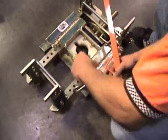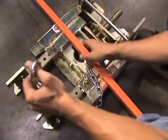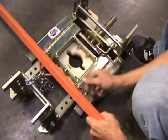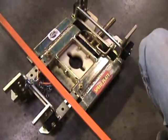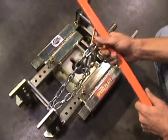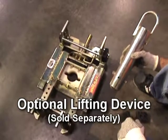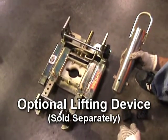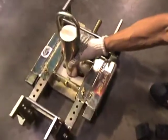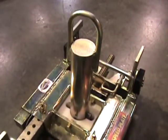You're going to want to clip the safety bar on the opposite end of the threaded wheel, which is your heavy end. That just keeps it from dropping down in the hole. Once your speed plate is locked into position in the frame, remove this before the cutting operation. It's used in cases where you want to use your six shooter to cut your hole and then come back the following day with just your speed plate and lifting device, which interfaces right inside it, to lift your casting from the road without using the six shooter.